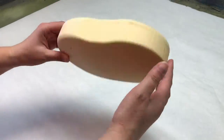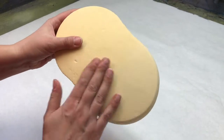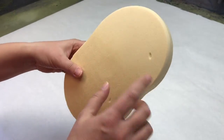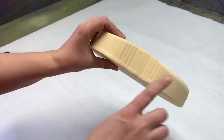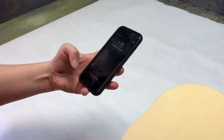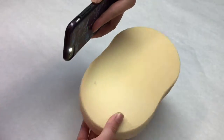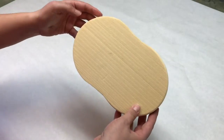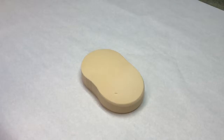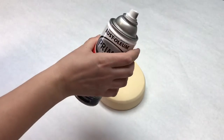What we have here is basically the full spectrum of pre-prep. Some areas have been sanded pretty well, some still have gouges — and that's okay for now. Some edges have had excess removed and some have not. You can see differences in surface quality if you look closely. After we spray, we'll start to see the differences that come from the various levels of pre-prep. When we paint, the first thing to know is we have to do this in a well-ventilated area — the spray booth is most appropriate.